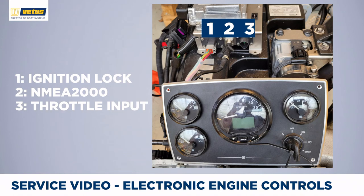The first example shows a Deutz engine. On top of the screen is the ECU — the engine control unit, basically the computer — and the dashboard on the bottom. Connector 1 is the ignition lock, a straightforward plug-and-play connector. Connector 2 is NMEA 2000 input/output, and connector 3 is where the throttle input will be connected. Typically the engine is supplied with a throttle position sensor — a mechanical sensor which connects to port 3. To connect the Deutz engine you have to cut that cable and check the manual to see which colors should connect to that connector in order to provide throttle data from the control unit to the engine.